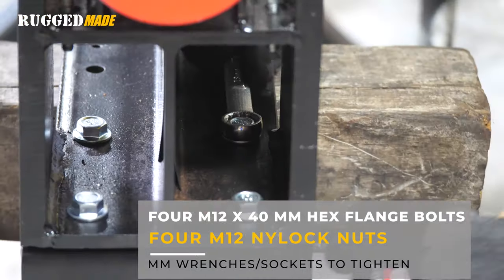Check for correct valve operation. The lever controlling the main cylinder should extend the rod when pushed away from the valve, and the rod should retract when the lever is pulled back and set into the detent. Check that the detent is working correctly — the rod should retract and then the lever should spring back to neutral by itself when the rod is fully retracted. The return detent is adjustable; depending on temperature and the type of hydraulic fluid you're using, it may be necessary to make a small adjustment. Moving the log lift valve lever away from the valve should lower the log lift and pulling it back towards the valve should raise it — however, this is personal preference. To change this orientation, switch the hoses on the A and B ports of the valve. Now that the log lift has been raised, install the lower half of the log lift tray — insert the two dowels into the slots and secure with the two pins and R-clips.